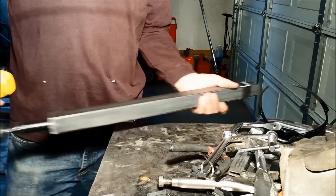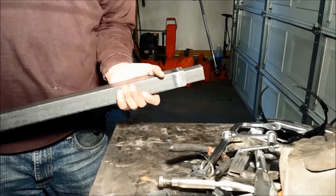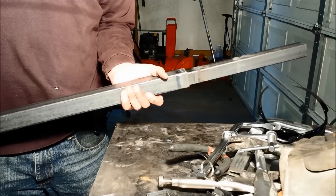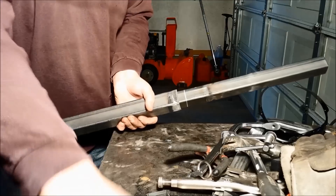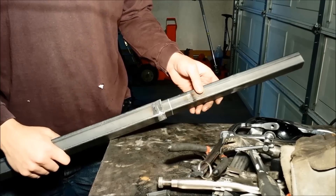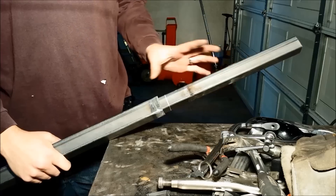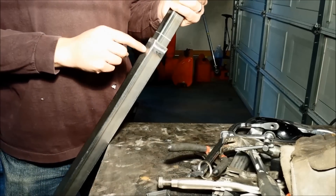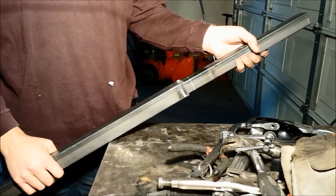You can screw in or out and what it does is raise this inner tubing like an elevator. I put a mark right there — that's a 13-inch mark. From that mark to the end of the inner tubing is about four inches or so. I can make it come up further if I wanted to, but you start to get a stability issue — there's more slop than I'd care for. So I decided 13 inches is the good mark where things seem stable. I do need to put in a bolt here that I can tighten down as a locking screw to help stabilize things once it's up in the air.